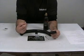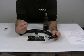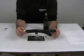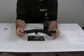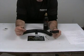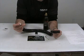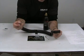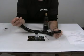What you need to do is inspect the o-ring. Remove it, check it for cracks, see if it's warped. If you don't see an o-ring inside — if it's missing — it's likely due to removing the quick release valve before depressurizing the system. What happens is 800 psi rushes into this quick release valve and the o-ring flies out from all the pressure.